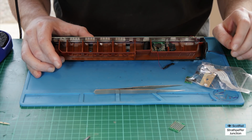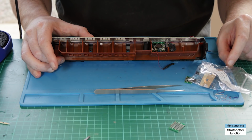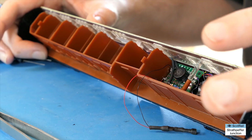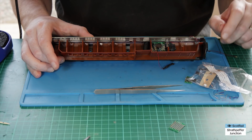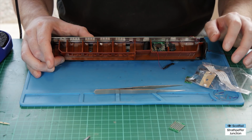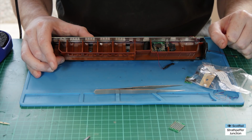Unfortunately, I don't have any in stock at the moment, so I'm going to use a 1000 microfarad capacitor, which is total overkill. I don't mean there's absolutely bags of stay alive capacity in this, but anyway, it'll work. But for anyone following this in the future, you can get away with a smaller capacitor. Anyway, so without any more blabbering, because this is now becoming a longer video than I had anticipated, I'll pop together very quickly the voltage regulator circuit.